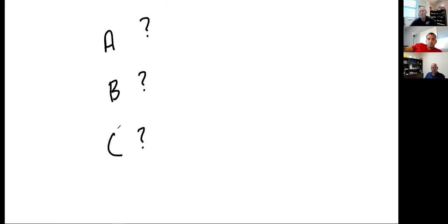With a rotation meter, with the rotation meter leads, RWB, how do they attach to each phase? How do they correlate to each phase? Red, white, blue: is it CAB, BAC, ABC, XYZ? So you've got to match the color coding with the phase in that multiple choice answer. Next question. What does a step-up transformer do? Multiple choice. Does it step down voltage, step up amperage, or step up voltage?